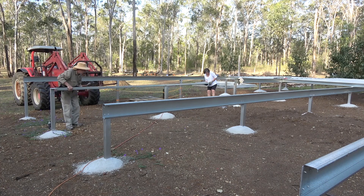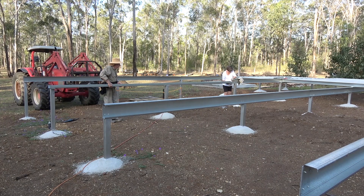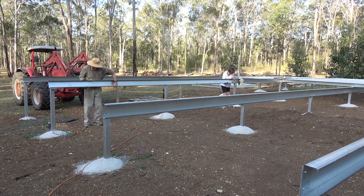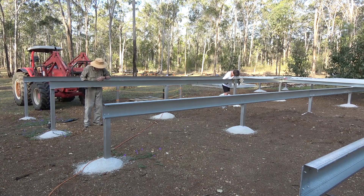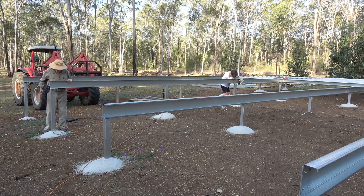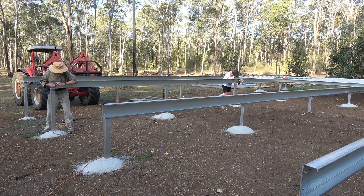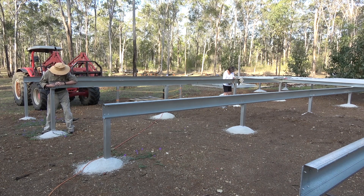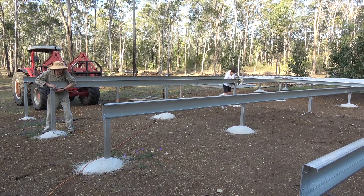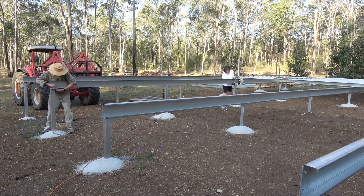This section is just putting up the joists onto the bearers onto the posts. I'm just finishing off the last bearer there. You'll notice the bearer in the foreground's 200 mil deep. The other ones there are about 150 mil deep, the ones we're working on. And the joist straps go inside those beams and then across the ones in the foreground.